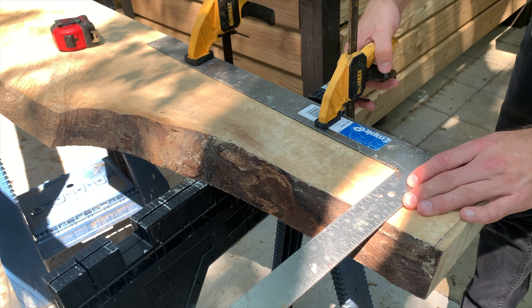Now we're going to pour the black resin for the second epoxy table. We're using Total Boat Thick Set Fathom again, but this time adding mica powder to give the epoxy a black color. We'll mix everything in a five-gallon bucket with a drill and mixer attachment using the same two-to-one ratio. I used just over three gallons on this table since it's a bit larger than the clear one. After mixing the epoxy and hardener together, I started adding the mica powder — typically around three to four ounces per gallon of epoxy. With around three gallons, I added about 10 ounces and gradually mixed it in until I had a nice uniform blend with no visible clouds of mica powder, which took around three minutes.